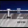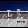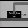The door is prevented from cutting the seal through over-tightening by the securing bolts bottoming out on the carcass return. So if a jet of water was directed at the door, the lid would move down, compressing the seal further. The lip on the door sits 2 mm into the seal, the material is 2 mm thick, and the water ingress path is a minimum of 6 mm.